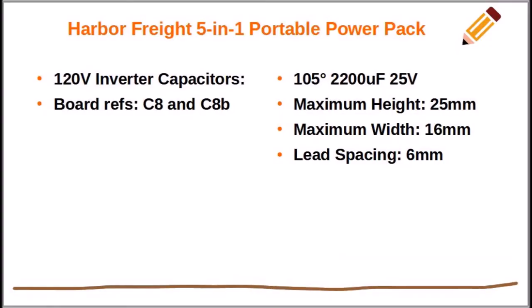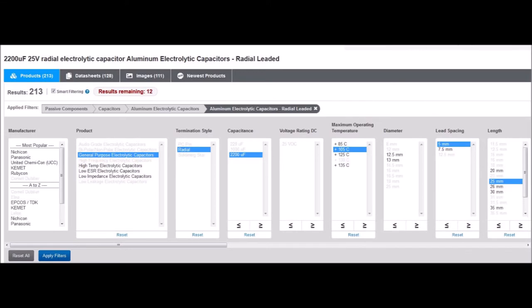Replace them both with 105 degree, 2200 microfarad, 25 volt radial electrolytic capacitors. No taller than 25 millimeter, lead spacing as close as possible to 6 millimeter, and the inverter should work better